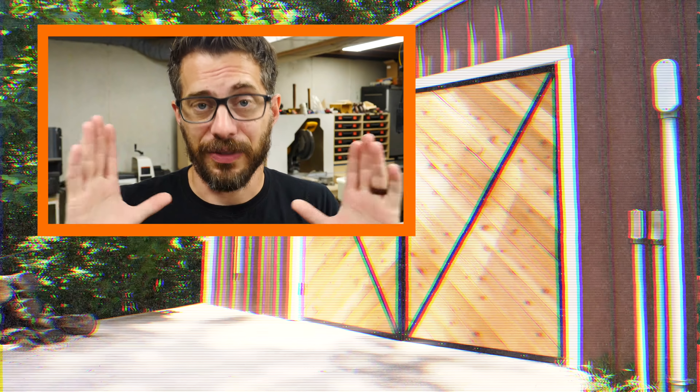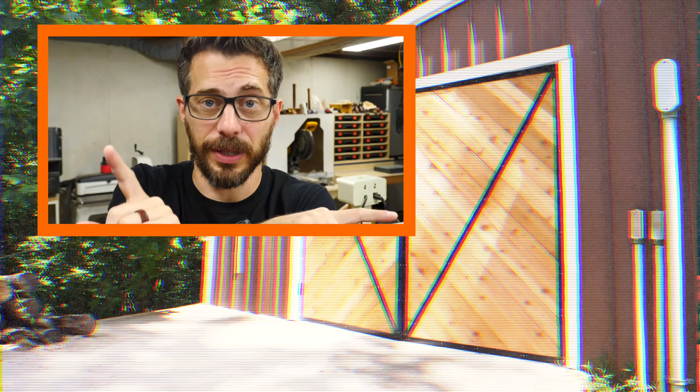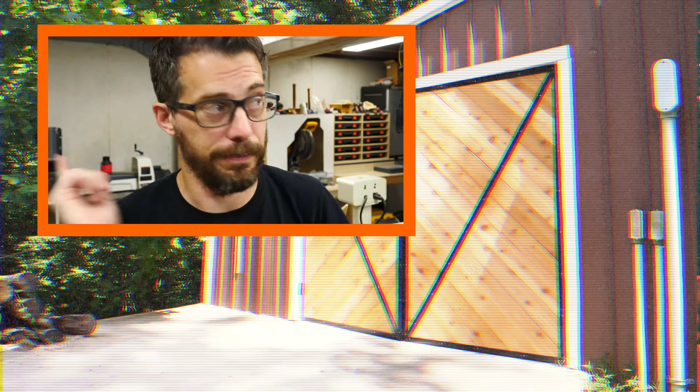Bob from the future here — I wanted to mention something I forgot when we were shooting. I've got the diagonal of these doors going toward the center. It's a steel frame and I think that'll work just fine, but on wooden frame doors the diagonals actually go down to the hinge so that the load is under compression. If for some odd reason these doors start to sag, I can just unscrew the hinges, flip the whole door assembly over, and put them back in — that will change the direction of the diagonals. Just something to think about in case you're going to make something like this.